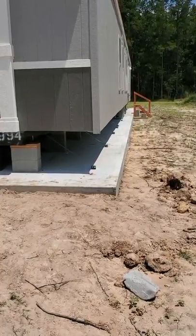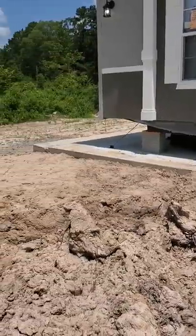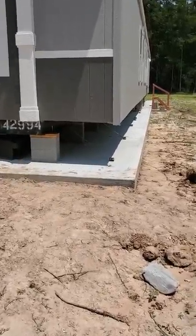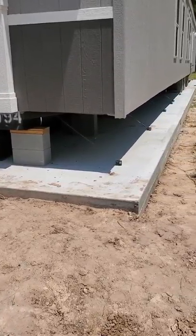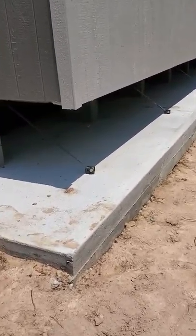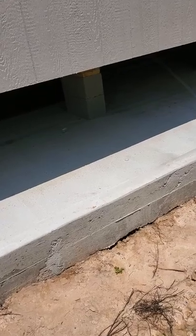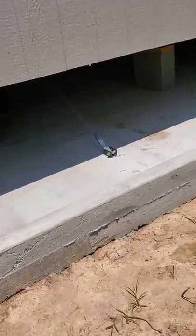This is a 16 wide by 76 and it's on a solid slab. Got a little chip at that corner where they loaded the bulldozer on it, but other than that it's one full continuous slab. It's supposed to be four inches thick — they built it up with dirt on the inside, packed it down, put in rebar and plastic. It looks higher on the edge so the footing is a little bit thicker, but it really looks good. It's solid as a rock.